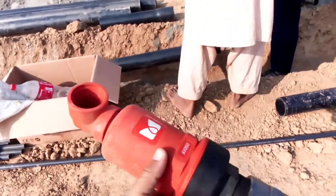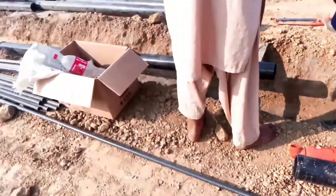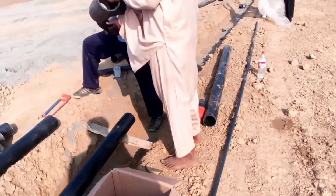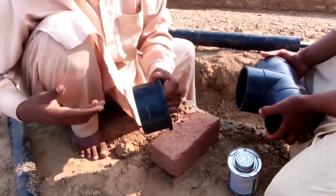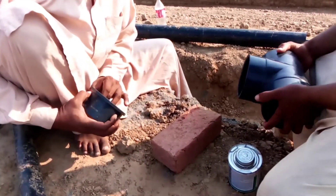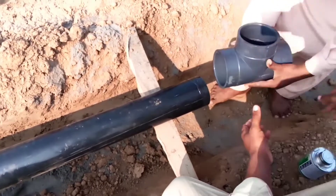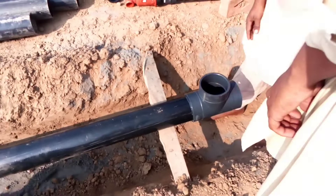This valve is made of HDPE polyethylene and we are going to install it on a four inch UPVC pipe. For that you have to put a vertical T. I have to convert the line from four inch to two inch diameter. This is a main T of four inch diameter. To install the valve and convert to two inch, we have to put a reducing bush — four inch by two inch — installed in the upward direction.